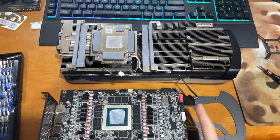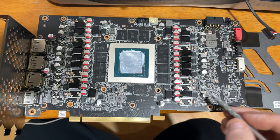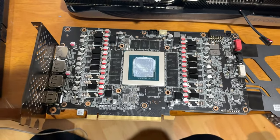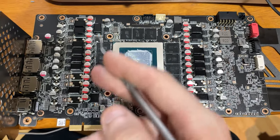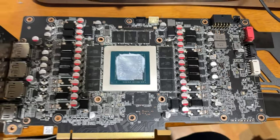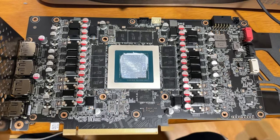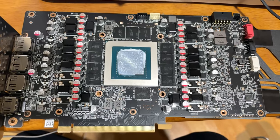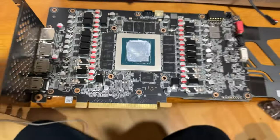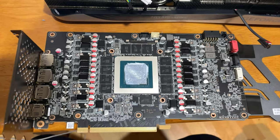The PCB size is here — the cooler is that big. Very small PCB. You can tell Zotac cheaped out a little bit by removing as many power stages and inductors as possible that they can get away with. But the whole power stage thing is completely overrated in my opinion — we were just pulling 500 watts with no issue whatsoever. Don't get hung up on the specs of the actual cards unless you're a liquid nitrogen extreme overclocker. Does the card work? Yes or no? If yes, enjoy your gaming. I really like the size of the PCB here — this is going to be very good for ITX builds.